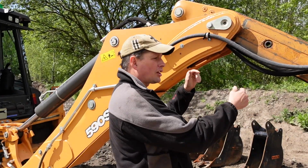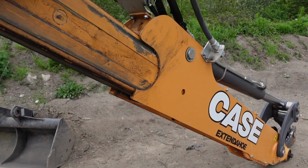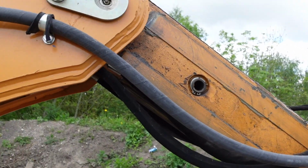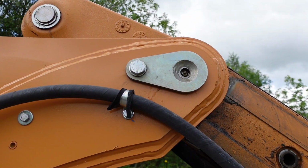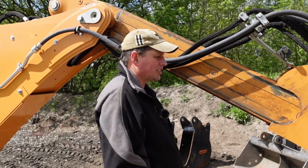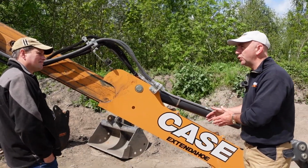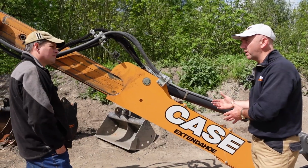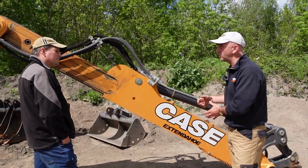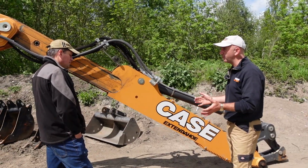Because there's a lot of other machines, that's fixed and the other piece comes out. Trouble is then, with that slide, normally covered in grease or whatever, it then gets covered in all the dirt. You bring it back, you hear it grunching and grinding and grunting. It becomes a wearing paste. Not very good. With what we call the inline configuration, you would never dare go near picking up that lump of concrete, moving that bit of steel, that RSJ that's lying around, and gripping it back against the back of the dipper. You'd never dare do it for damage.